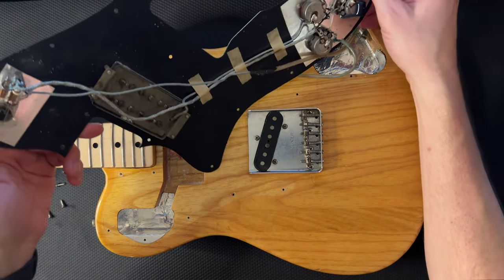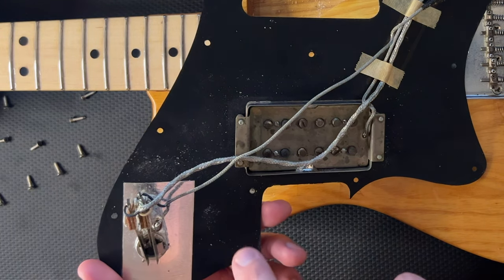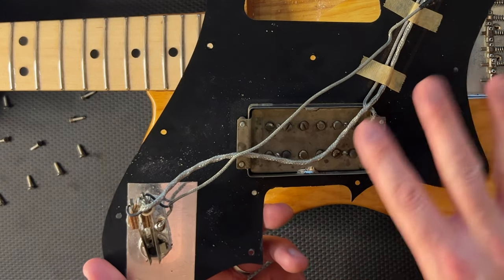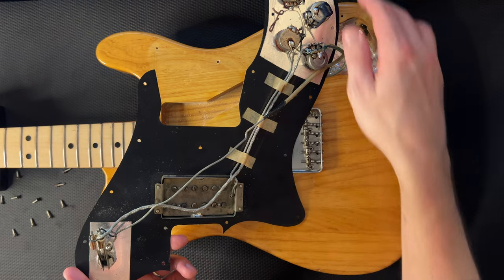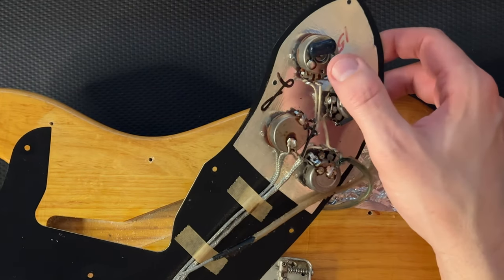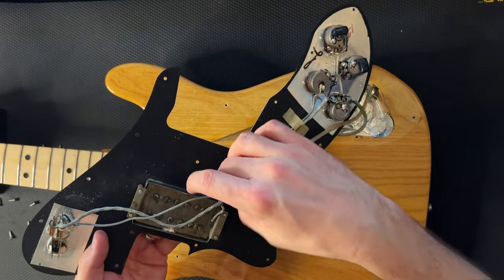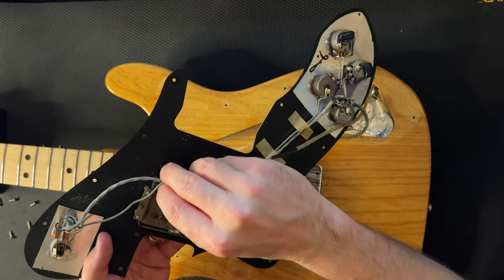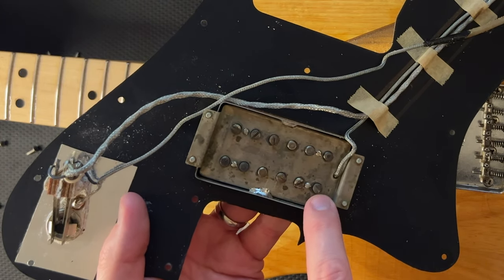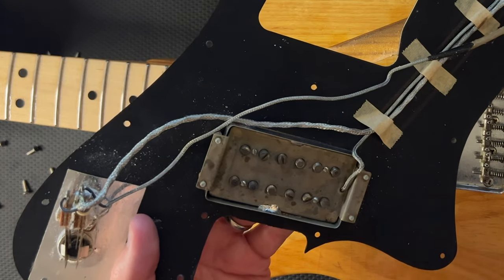It is like a time capsule under there. One of the coolest things about this is seeing all the dust, and seeing all the areas where you can tell this really hasn't had much done with it. The tape is the original tape, and the pots are just completely untouched, which is fantastic. Another great thing to look at is this wide-range pickup — you get to see the slugs underneath and then the screws on the side, and on the opposite side there's the screws and then the slugs. What a cool design — a Seth Lover design.